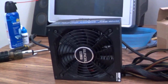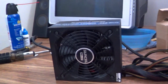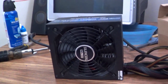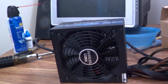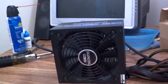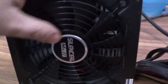I mean, I have seen explosions and smoke shows with power supplies when transformers blew out. In one case, because a guy building a power supply wired it in backwards. So instead of stepping down 120 volts to 12 volts, it stepped it up to 1200. But anyways, I usually am a big fan of buying power supplies by the pound and looking for heavier components, thicker wire, and other telltale signs that corners weren't cut, in order to know that you're buying something rock solid that's going to last for years and years like this thing did, and not potentially take your system with it.